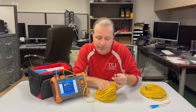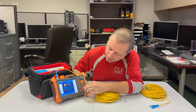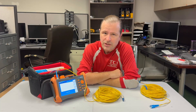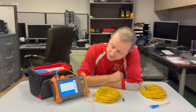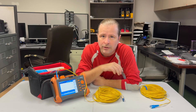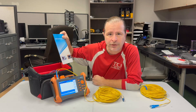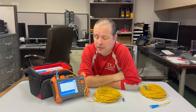When you're in the field things get dirty and dusty. Let me show you how we do a very simple test with this OTDR. First thing I'm going to do is break apart my coupling and plug in via the SC connector directly into the head of the testing unit. I'm going to connect in a 30 meter segment — this is roughly 100 feet give or take. On the home screen I'm going to initiate a test right now just so you can see a sample of the graph that it generates. This test runs for approximately 15 seconds the way I have the machine set up.